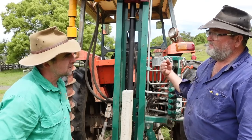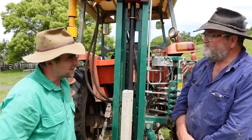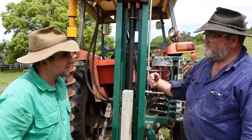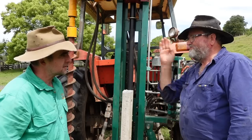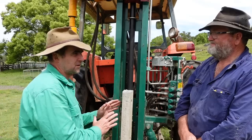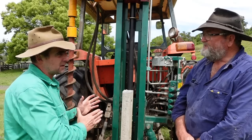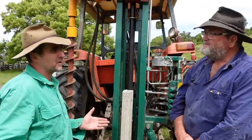I do prefer to. It's probably a little bit slower but I do all my own fencing, I'm not a contractor. So I like to have it nice and straight. But we do back in from the side and we drive each post back in from the side purely for the fact that you can look through the holes and have all your holes lined up down the line. So when you pull the wire through everything goes through nice and easy. So you're using your holes as a gun sight to line up your fence. That's correct. And that's why you don't want the tractor in the way of that and you back in.